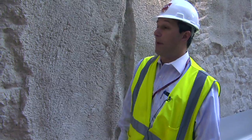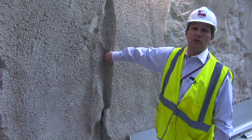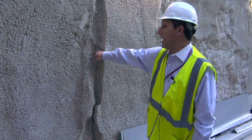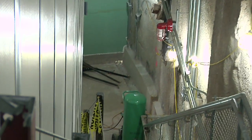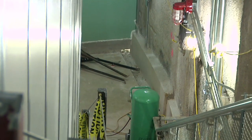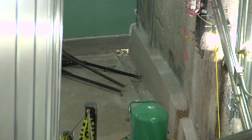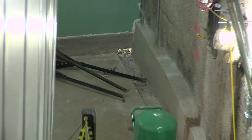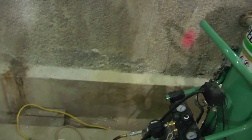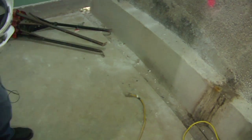Once the panels are installed, we put in these end stops to prevent water leakage. So far they're working — you can see how dry it is. A lot of people are asking how we're going to keep back moisture. A slurry wall is not a waterproof wall; however, it is designed to keep the foundation system intact and relatively dry. But in the event that we do have some seepage, we have a trench drain down at the bottom that will carry the water to 350-gallon-per-minute sump pumps.